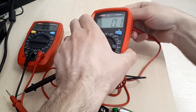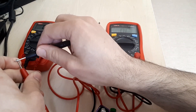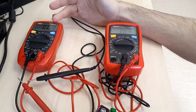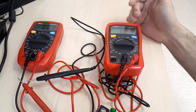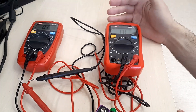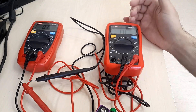The value is shown slightly slower on the newer multimeter than on the older one. But the difference is that when you see the values changing, they change much faster on the newer one. So the refresh rate, or the number of counts being presented to the user, is higher than in the older one, although the actual precision of the multimeter is probably not that much different.